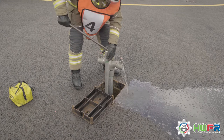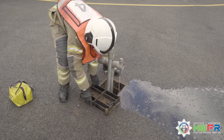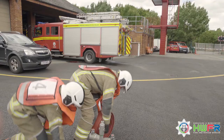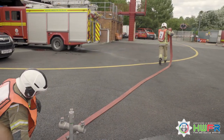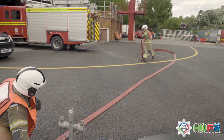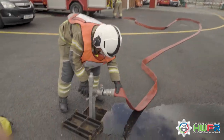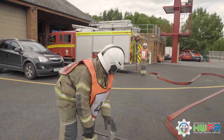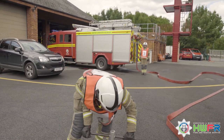The bar is then replaced in the key and the hydrant plate is covered across the opening. Number two runs out one length of soft suction to the rear of the appliance. Number four connects it into the standpipe. Number two asks for water on, and number one and number four slowly open the hydrant.